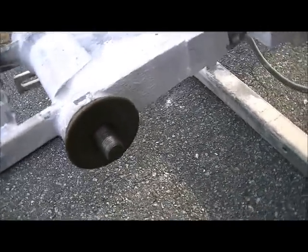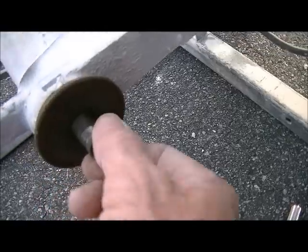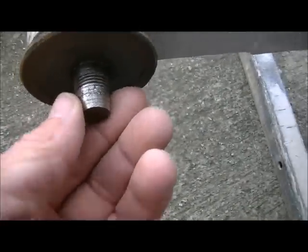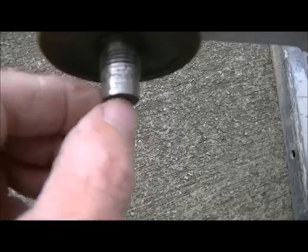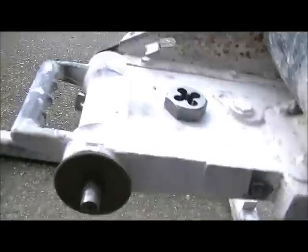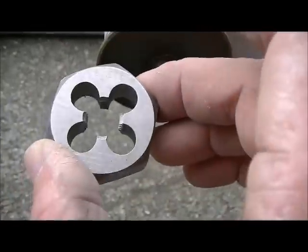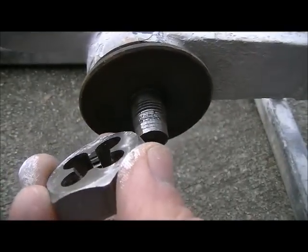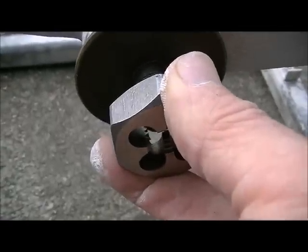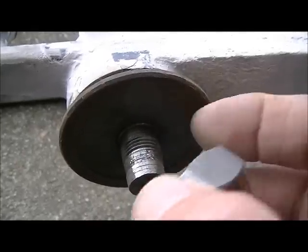I'm going to go off camera and see if I can get the end of it tapered down a little bit so the die will fit correctly. So far I've managed to get the taller edge on this spindle sanded and ground down a little bit with my electric grinder. My die, with the tapered edge, now kind of fits right on there and sits on it. Once I put some pressure with the handle and get some oil on it, it should start threading all the way back to almost the end.